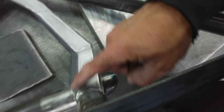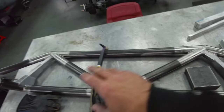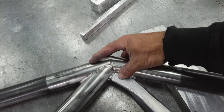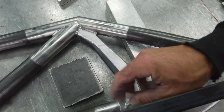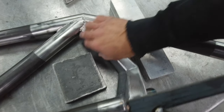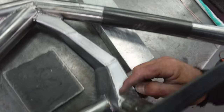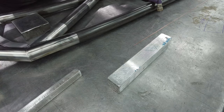I'm gonna hit this line first, probably do the whole thing, and jump over back and forth, back and forth. And maybe start some of these other intersections that aren't intersecting with the plate work, because I do want to weld out, like we talked about, having a story to tell: you weld the plate area first and it looks like that got welded and then it went into the tube structure and then welded to the tube structure. So there's a lot of pathways here you can choose for design aesthetic too. So something else to think about